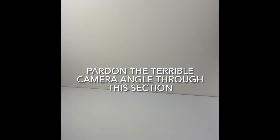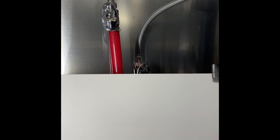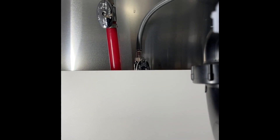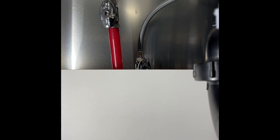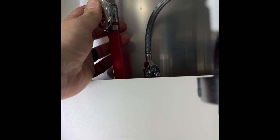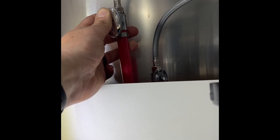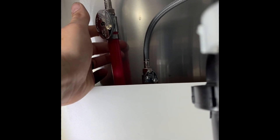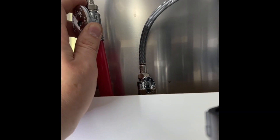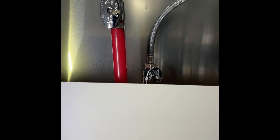Go underneath. As with any faucet, there's just the two water lines — pretty straightforward. If you've done any plumbing in the past, you're going to be very comfortable with this. One of the big things that led us to the Ikea faucet was the single hole design and we got lucky on the fittings. These are very standard fittings. In the past we found that Ikea ones don't fit standard plumbing fittings for houses, but it seems Ikea has changed that in the last couple years and now they are compatible. These fittings have O-rings in them. It's a five-eighths wrench to take them off on both the hot and the cold. It's a piece of cake to get them loose — they're not even that tight. Because of the O-ring design, you don't have to go that tight when you're tightening them either.